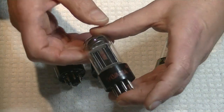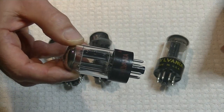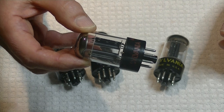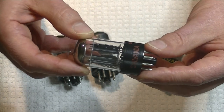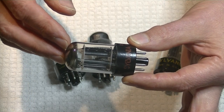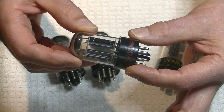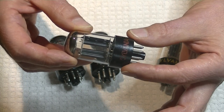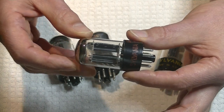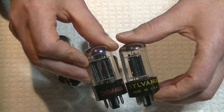Many of you probably thought the red label had something weird going on. Well, there isn't anything weird at all. Sylvania ran a program in which they guaranteed replacement tubes to technicians and shops. Anybody who was a pro handling tubes could bring back any dead Sylvania tube and get a replacement, but you had to bring back a red label showing it was in the warranty program. So this is basically a commercial Sylvania 6SN7 GTB - just a different colored label.